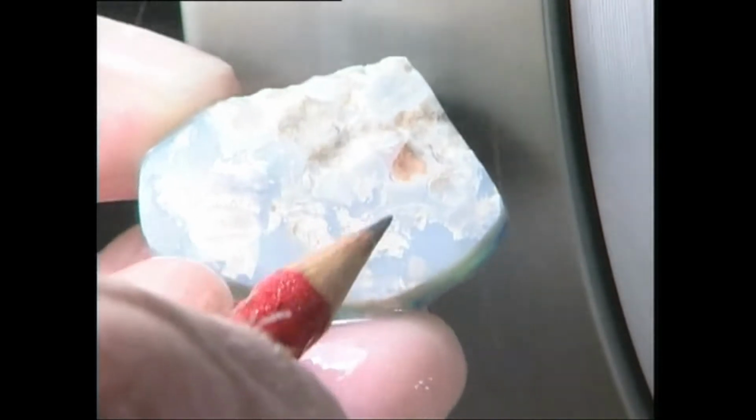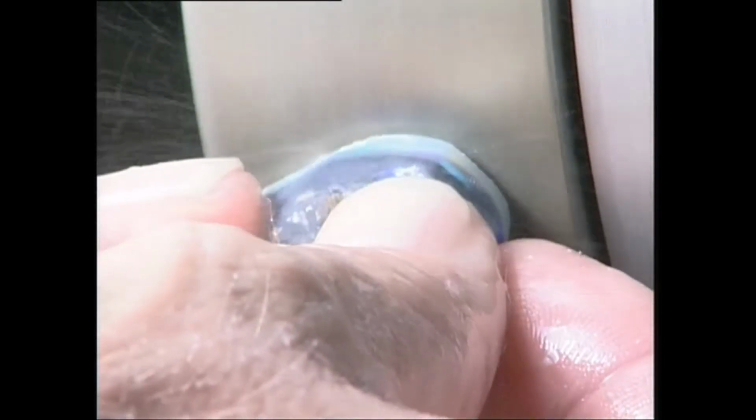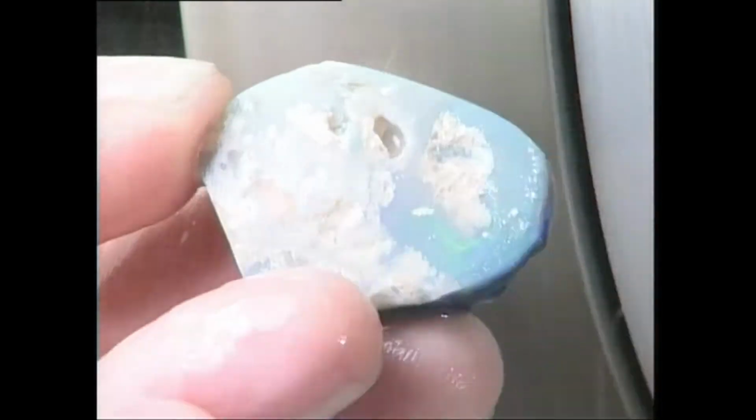See sand problems in here, and through this area, and here even under the skin. We still may get rid of a lot of that as we go down. As I said before, work it evenly around the piece, making it down equally. Getting a sense of balance here, just slightly doming it. A major problem here. Sand's blown out, leaving a hole right in where that kernel is. That'll be unusable in that area.